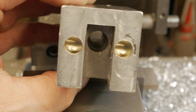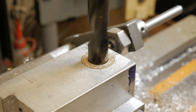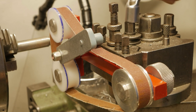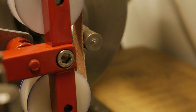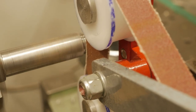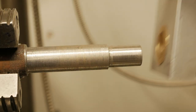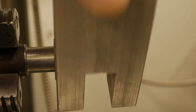As you can see from the rotation, the result obtained was truly satisfactory. In fact, the block rotates very precisely on the shaft just built. My lathe sander proved to be a very nice and useful device, and after making this small adjustment, I then cut the shaft to the finished length, and so the central shaft was finished and ready to be installed on my aluminium block. The fit with the bushing was really perfect.